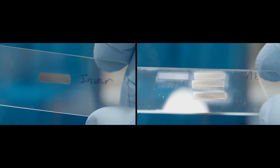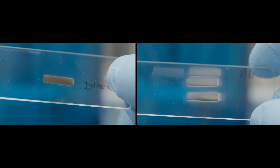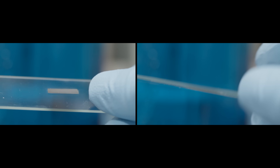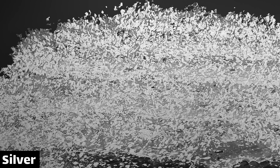Invar 36 and niobium both appeared to deposit pretty well. I don't have a great method to assess their quality, but they left metal on glass and it was conductive enough that it seemed to have worked. Let's take a look at some of these samples under the electron microscope to figure out the mechanism of action, and whether samples like the Invar retain their alloy composition or separate into multiple components. Let's start with silver since it was the most conductive.